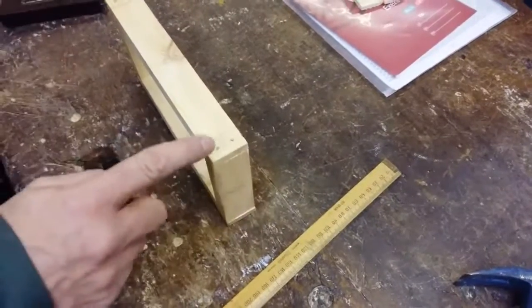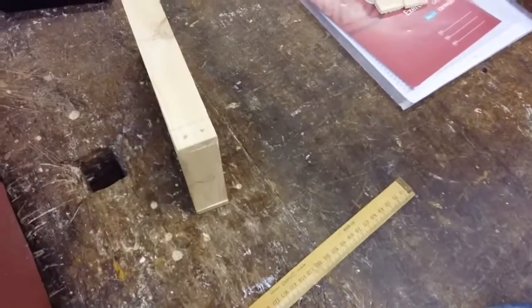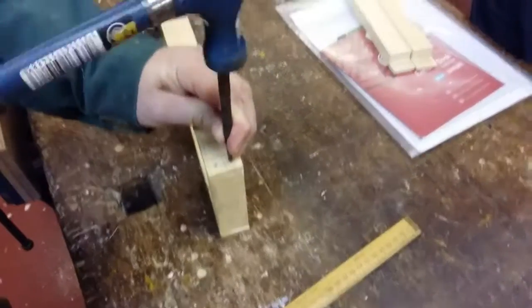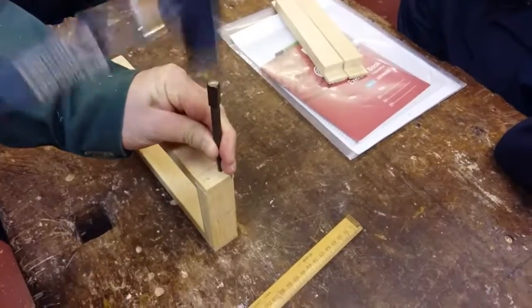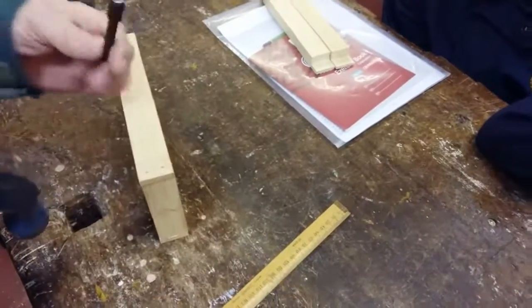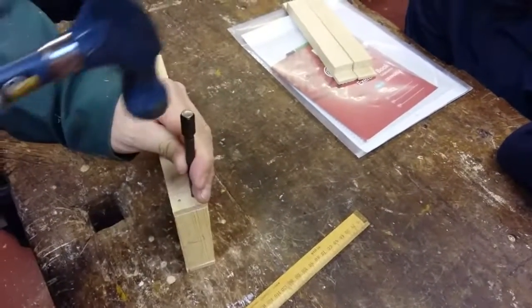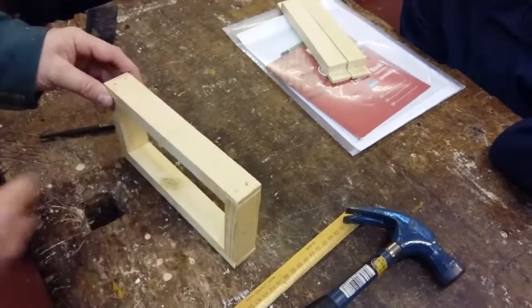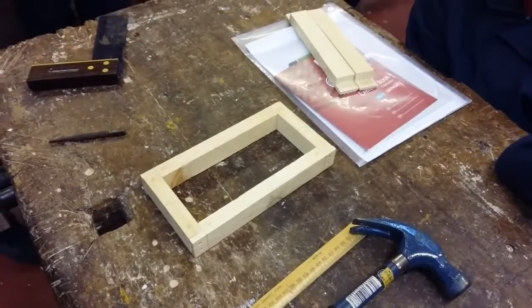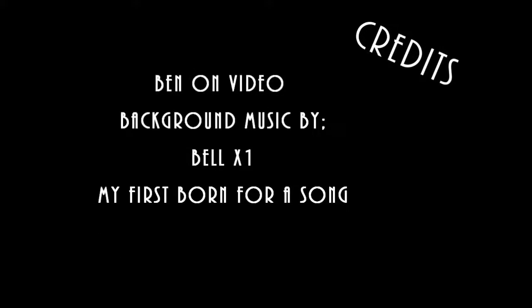Providing that your pieces have been cut well, you should be able to get the piece square. Another method of checking if it's square is measuring the diagonals — one diagonal distance should be the same as the other, and that ensures the piece is square. That leaves us ready for the next part of the project, which will be putting on the base and the top. Normally when dry we would punch the nail heads, but for this video: you want to sink the nail heads a little bit below the surface. In the next video they show how to apply the filler and clean the pieces up. If the nail head isn't punched enough into the wood, it won't take enough filler to stay in, and it'll probably end up falling out or creating a lump on the top. Thanks to Ben for doing the video today.